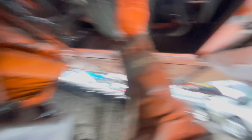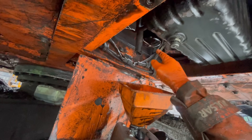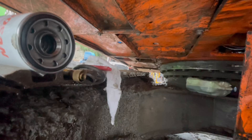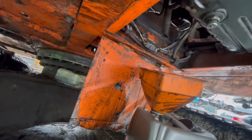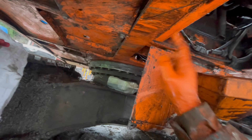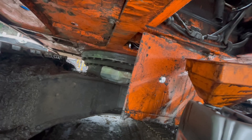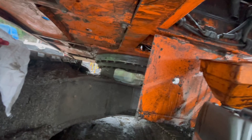I've drained the engine oil out and it's stopped raining — happy days. About 27 litres of engine oil in here. I've loosened that filter and let it finish running out, then we'll get it spun off and the first genuine filter fitted. I'll use my grips to give it a gentle nip — just a bit more than hand tight for those filters. The slew gearbox oil is still running ever so slowly; it's the first oil to drain and the last oil to refill.